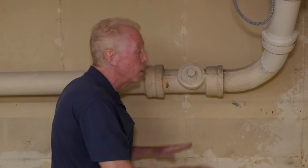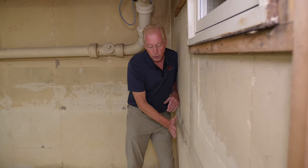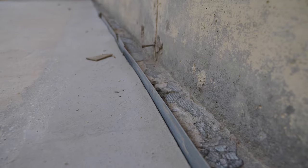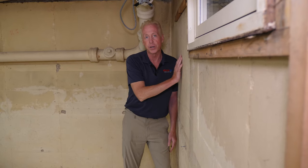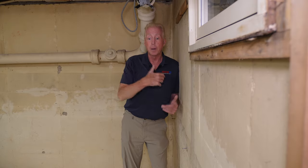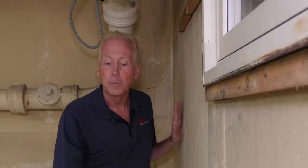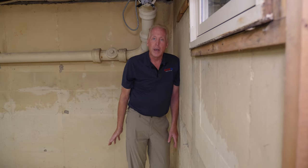We take off a whole bunch more stress from that water that builds up in the backfill area — that false water table we've talked about in so many of our videos. The other thing is this system has been installed about two and a half to three inches out away from this wall. There's a reason for that and it's probably the worst reason in the world — this wall was finished with drywall and paneling that the customer removed prior to us coming out. What this waterproofing company did is put their system right in front of a studded-out wall.